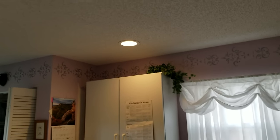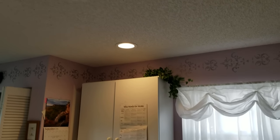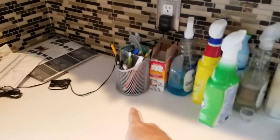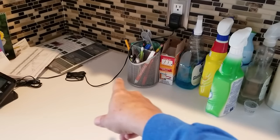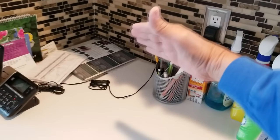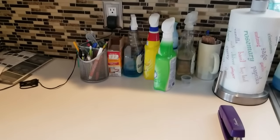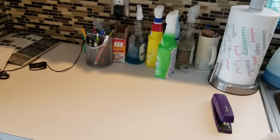Here's another example of a property with a bad lighting design. If you look in the kitchen, you can see the shadow on the counter right underneath the cabinet — whereas in the kitchen I just finished, I had bright light going all the way back to the corner. The reason is the builder put this down light basically just in front of the cabinet — I don't even think that's 12 inches in front. It shines most of its light as a hotspot on top of the cabinet, then gets dimmer going down, leaving a dark shadow on the counter. The people who designed this house had absolutely no clue what they were doing.